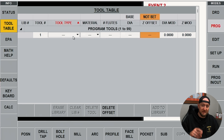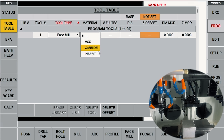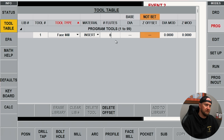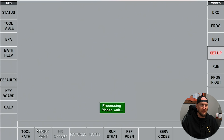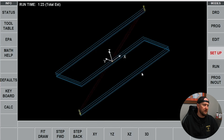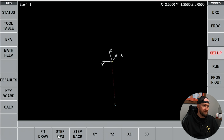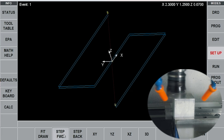Now we go to the tool table. My tool one we're going to set up as a face mill. Material — this is the material of the tool, not what you're machining — is going to be insert. I have a six-insert face mill; diameter is two inches. We'll leave the offsets at zero for illustration. Now when I go to Setup and hit Toolpath, this shows me what that toolpath is doing. I can pull this around just like in Mastercam or any CAM system, and I can step through it to see exactly what those passes are going to do. Easy — no geometry needed.